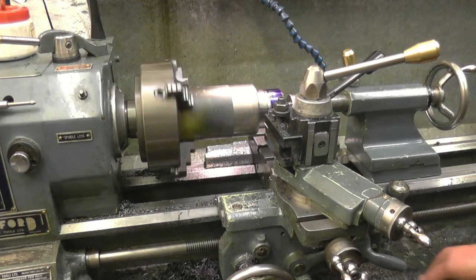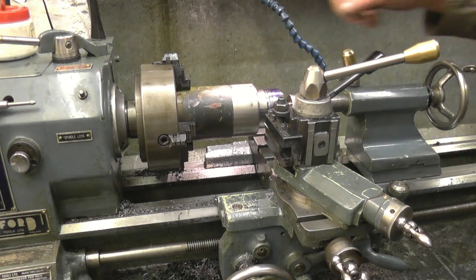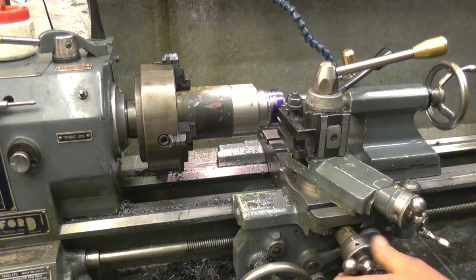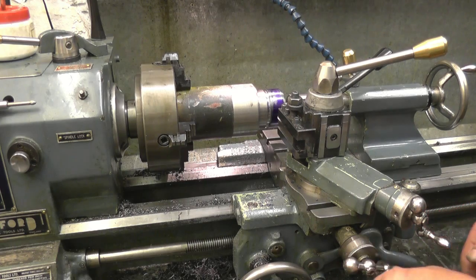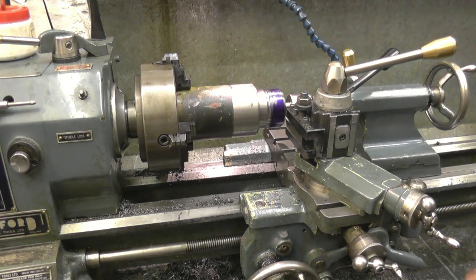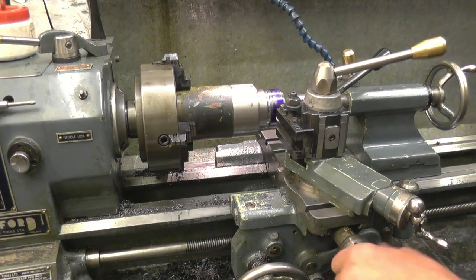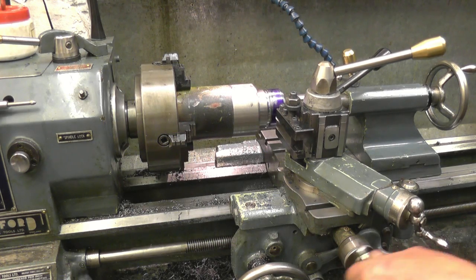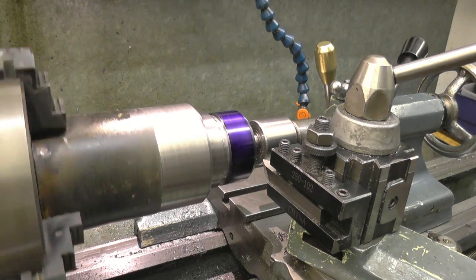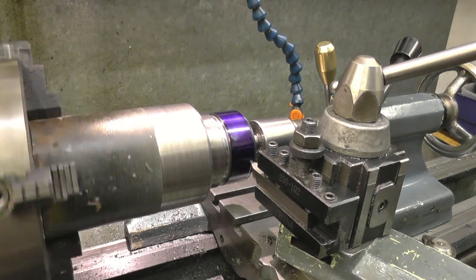The carriage is going towards the chuck — that's what we want. This lathe has got a thread dial indicator, but for such a short coarse thread I won't use it — I'll just reverse the lathe. First thing is to get the tool to touch the job and zero the cross slide. Wind it out to 100 thou — one full turn. We're going to put the feed on with the compound slide. That's zeroed as well. So we'll go in to zero, put feed on the compound slide, back out. We'll start the lathe up, nice and slow at first. Engage the nuts — the nuts are well engaged.